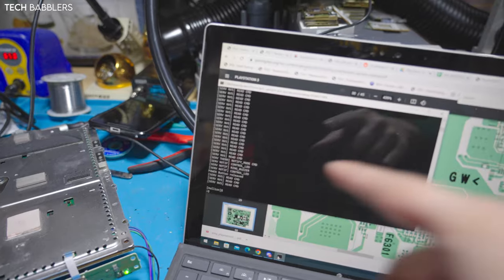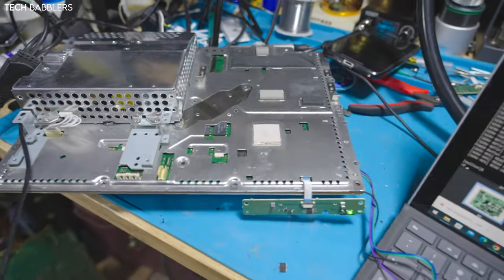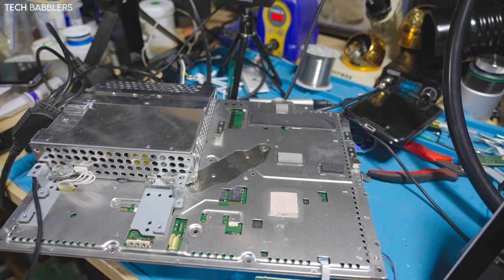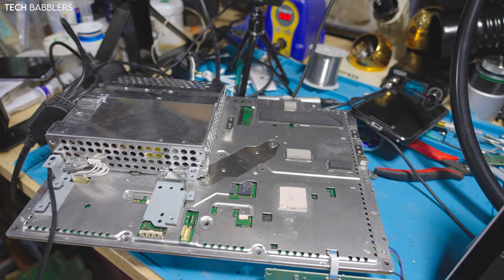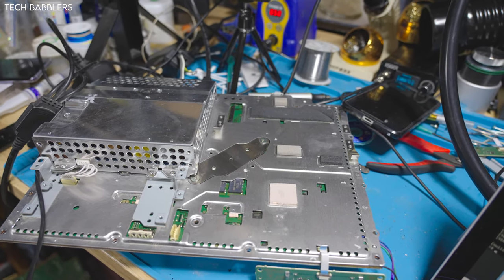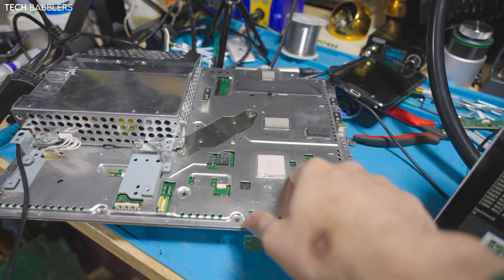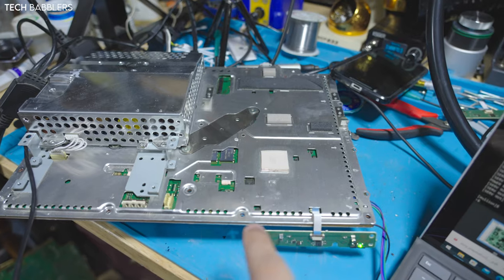I mean, it is booting as you see over here. We're on read CMD, so I don't know. This might be, oh boy. So for this one, it might be a green light of death, where it's on a lower firmware. If it is, that's pretty sad. Let's diagnose that one. I think I need to SBUART, which I've never done before, so let me jig it all together and we'll get back. But at least we know the GPU works.